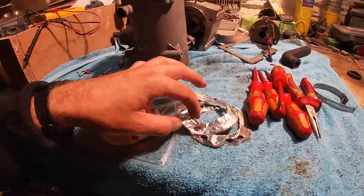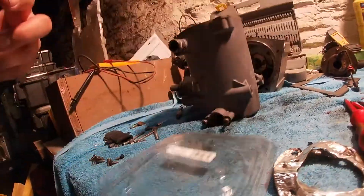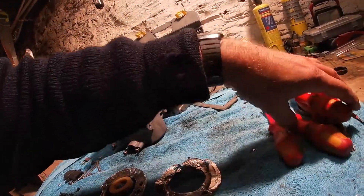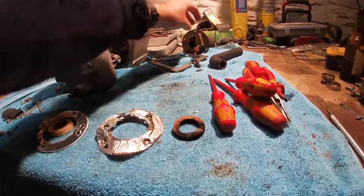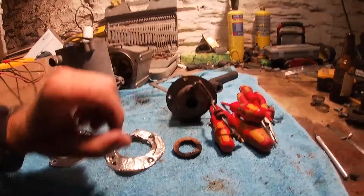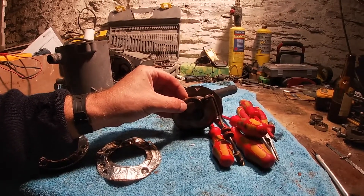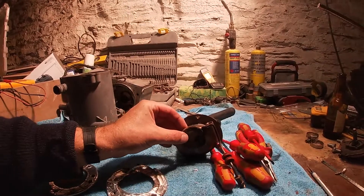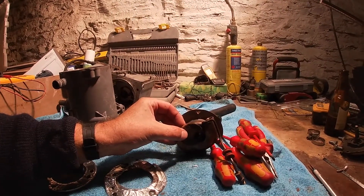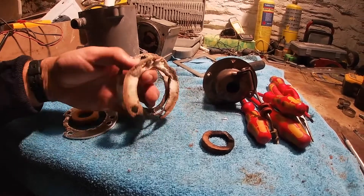So that was the old seal — you can see the difference there. That was the old seal because it was half trapped in the burner, something like that. Well, that's just ridiculous — it's going to starve it of oxygen because it's halfway across the aperture where the air gets blown in. So anyway, this one had just seen better days.